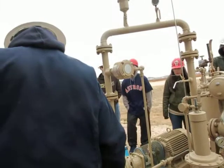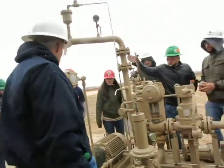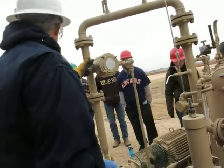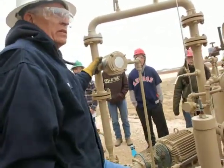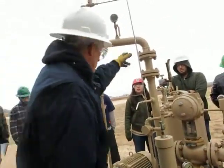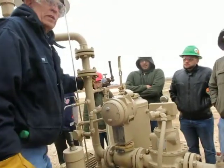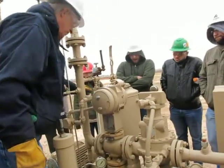So this is tied to the bottom of the tanks. It comes in here to a pump. Then we pump it up, and we go past right here. This is a probe. And with that probe, it's going to take a measurement of the BS&W. If the oil is good, it'll go through the system to right here, and this sampler will open, and it'll let a few ounces of fluid go through for every barrel into our sample tank.